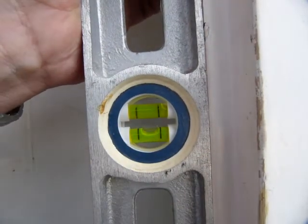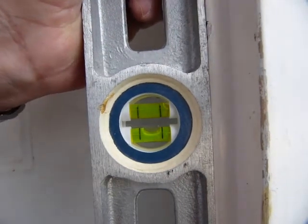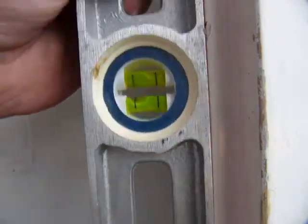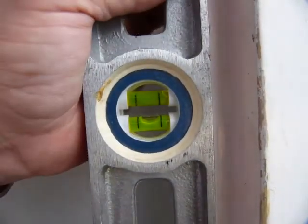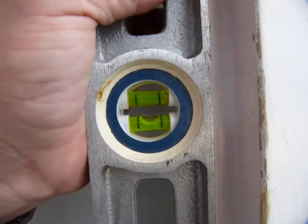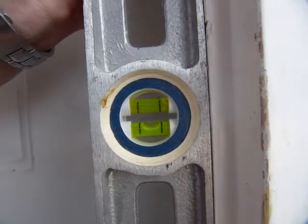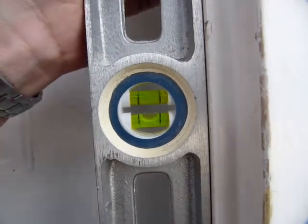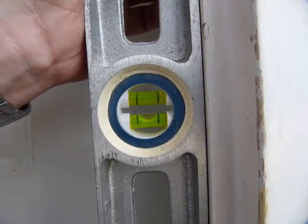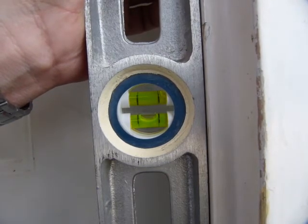The reason for the apparent difference is that I slid the level vertically up and down — I couldn't lower the camera four feet, so I raised and lowered the level, but it has to be in exactly the same spot. When you check your vials, flip it only this way — don't move it up or down — because it won't be accurate. That's how to check your level for plumb.